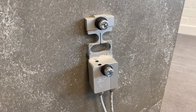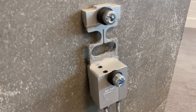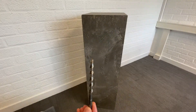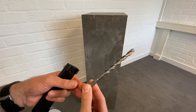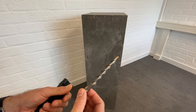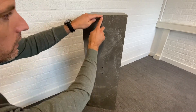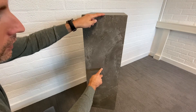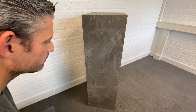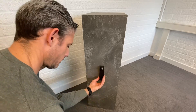I will provide you some brief information today about sensor mounting for the PDA DLT system. In order to do the sensor mounting properly, you first need to drill holes in the concrete pile which you are going to test. I have a dummy pile today and normally the sensors are being mounted roughly 1.5 up to 2 times the diameter from the pile head.